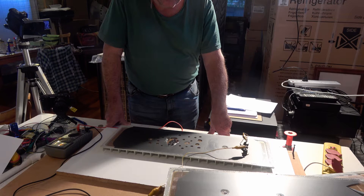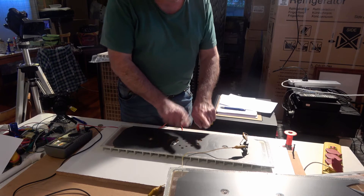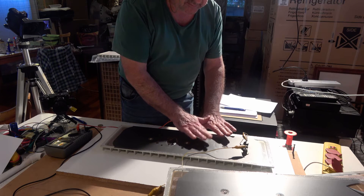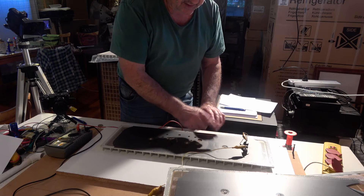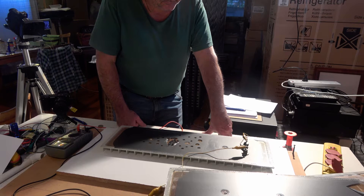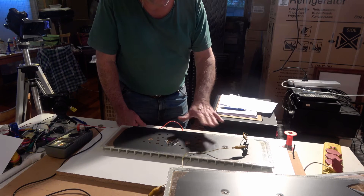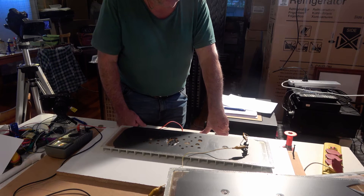I'm not sure if I'll do the four probe method. I may actually build a square type — two parallel plates of copper separated by the same width as they are long, so you have one square of, for example, 15 by 15 millimeters. That should do the job. Once again, it has to be small in relation to the area you're covering for greater accuracy.